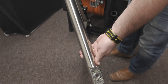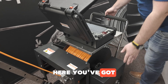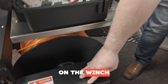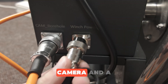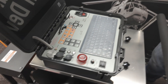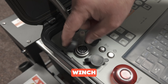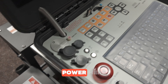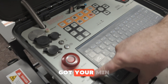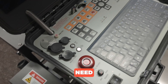The side view camera also has manual focus, which will be controlled on the monitor. On the side you've got the counter plug for your counter system, which plugs into the monitor. On the back of the winch system you've got a plug for the camera and a plug for the winch power. When you look at the monitor you can see the counter connector at the front, the camera connector on the winch, and the winch power connector. On the winch you've got min and max speed, reeling down or reeling back up, and an emergency stop.